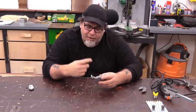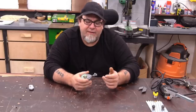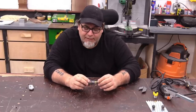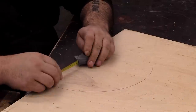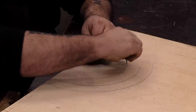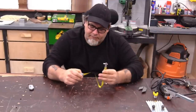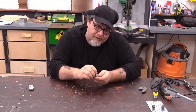Last but not least in our six tools is this fella — a rototape. For marking out radiuses, you've seen all kinds of jigs on YouTube or homemade compasses, but this makes it really simple. It works just like a tape measure — pull this lever down and pull it out to the distance you want. There's a pin on the bottom that you set in place, and there's lead that goes in the end so you can mark out whatever radius you need, all the way up to about six feet.